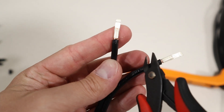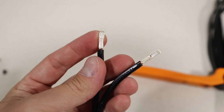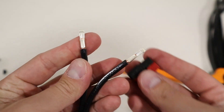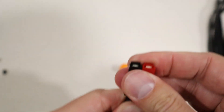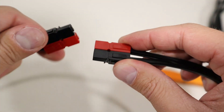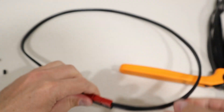So we have one wire hanging off the side. I have these very fine clippers, and I just get it at the base and chop it off — now it's gone. I'll include all the parts I used in the description of the video. Bumpy side is negative. Let's go ahead and put them together. Sometimes one side will snap in and the other won't, but both of these snapped in good. What's awesome about Anderson PowerPole is you cannot connect them backwards — you can't mix up polarity. They snap in very nicely.